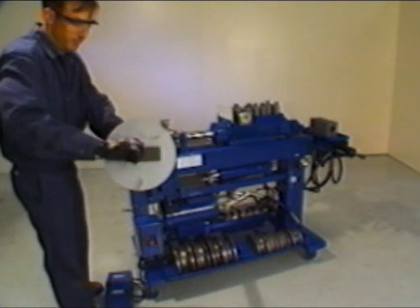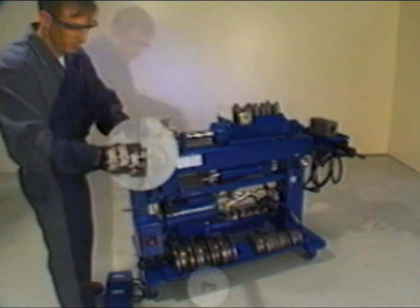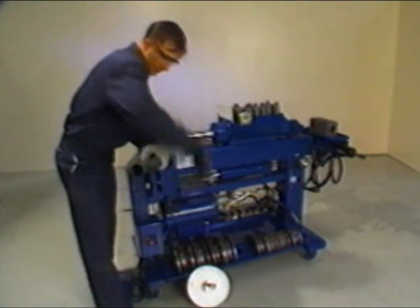You are now finished bending the pipe. Remove the rotation dial and cut the tubing off at the last overall length mark. Now check the bending instructions section and check for any end finishing requirements.